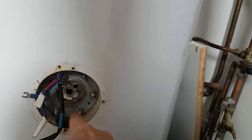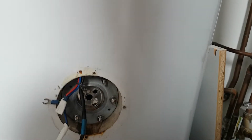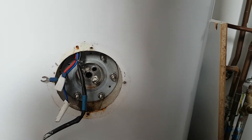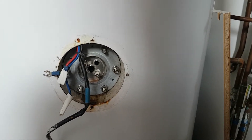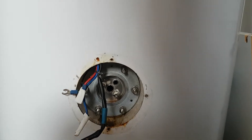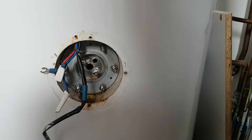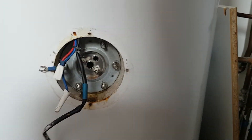It's this kind of fitting - there's a steel ring on the outside with these nuts on. You remove those and inside there is a heating element. I've tried several different types from China, but for some reason the stainless goes porous. They're 220 volts, the voltage here is 240 volts, and they're 1.5 kilowatts, but they don't last very long at all. I carry several of these - I've imported them because they were like 45 quid from the supplier, but they're about $6 in China and they're identical. So I've imported a whole raft of these heating elements for $6 from China.